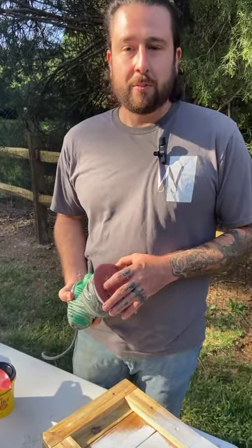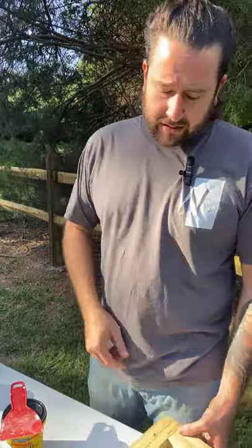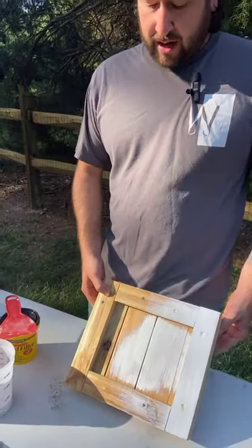You can also use a palm sander — kind of the same process. Probably if you're not used to using any power equipment such as a sander, I would recommend starting with the palm sander. It's a little less aggressive than the orbital sander. Start with a 220 paper, and if that doesn't get out whatever imperfections you have, you can always go down in grit number from there.